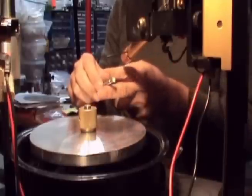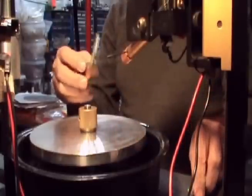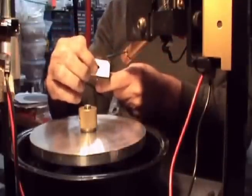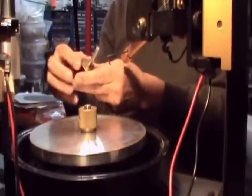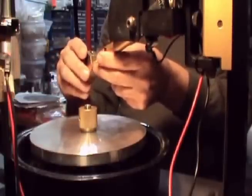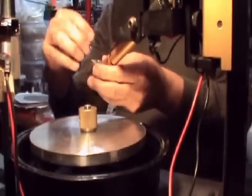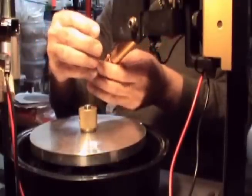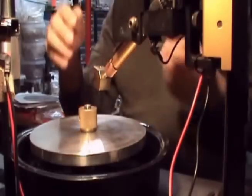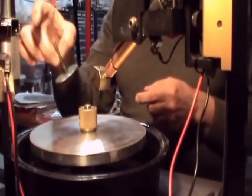In order to do the table I need to use the 45 degree adapter. Looking at the adapter itself, you have the hole here for the dop with the stone, you get the other dop that fits into your machine, and you have the machine where you fit it in. Adding all this together, the errors between these holes will accumulate and 99 percent of the time you're going to end up needing to readjust your cuts by using the cheaters when you finish the table.